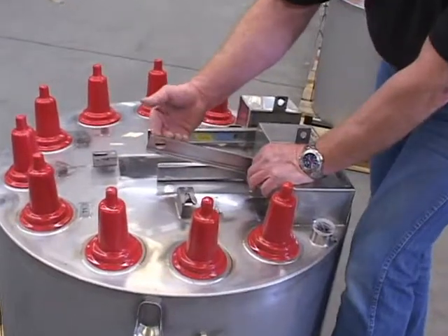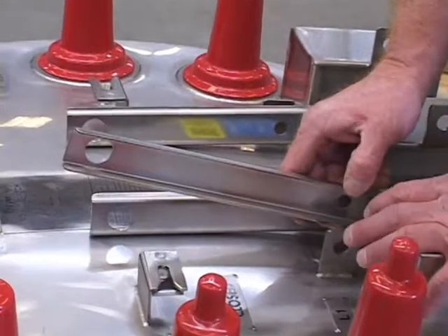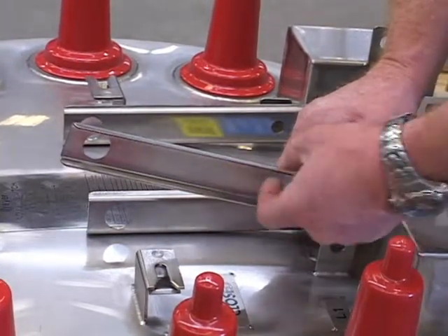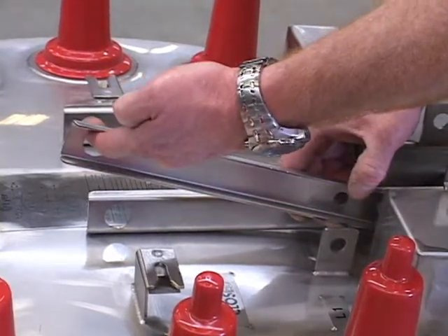At the end of the channel is the operating hole. The reason that we form a channel for our handle is so that the lip of the channel acts to guide your hot stick into the operating hole.